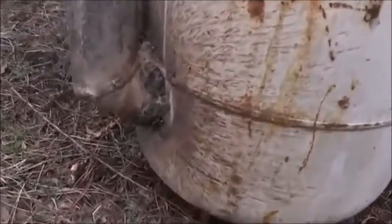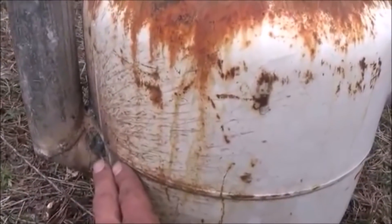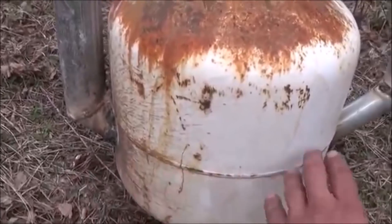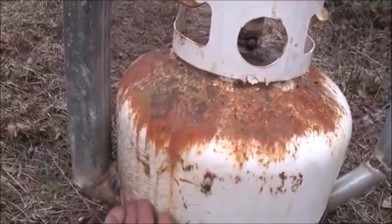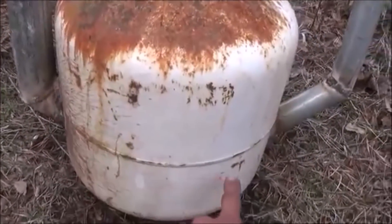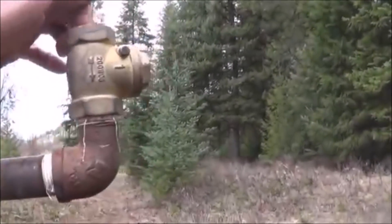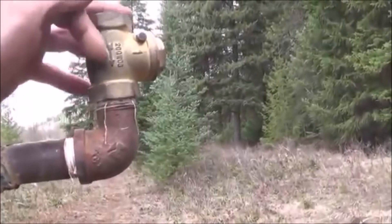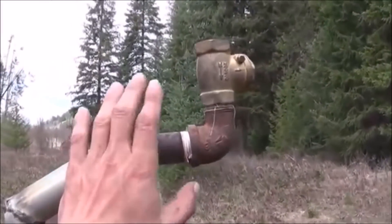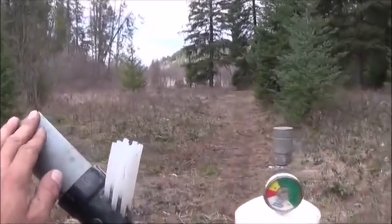Water's going to come in carrying air, bringing it in right about just below the center mark of the propane tank. The air itself is going to get dispersed — it's going to be released by the water slamming into the tank. All that air is going to rise up above the input and get stored right against this. And as the speed of the water goes by and comes up the pipe, this one-way valve right here closes in this direction — so flow would be this direction — just like the water ram.